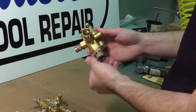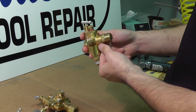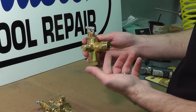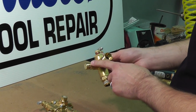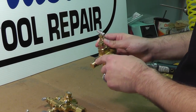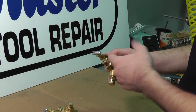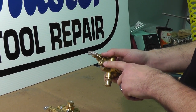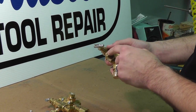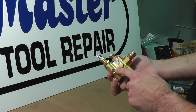This one has a half inch MPT outlet to your tank, and the inlet is actually on the side — a large three quarter inch compression style inlet which your transfer tube will attach to. Here we have the exhaust port which exhausts air when it idles. There's also a cold start valve to relieve any excess pressure in the line when it starts — essentially a redundant head unloading valve. And we have our eighth inch for throttle auto control to your engine, and the toggle.